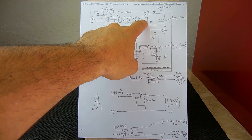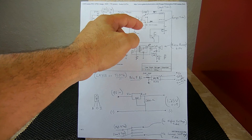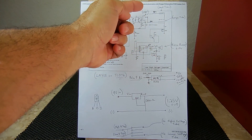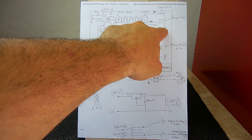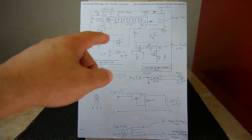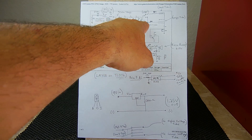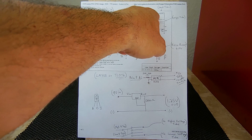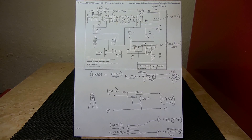From this point the circuit goes into the center of a single-pole double-throw switch — preferably a high-voltage switch. In one position it routes high voltage to one tube; in the other position it goes to the other tube. Both cathodes of the GM tubes are connected together before going to a 10k resistor. It's very important that the voltage range of both tubes is very similar. You don't want a 400-volt tube paired with a 700-volt tube on the same switch, because applying 700 volts to the 400-volt tube could cause the gas inside to ionize and glow like a neon lamp.